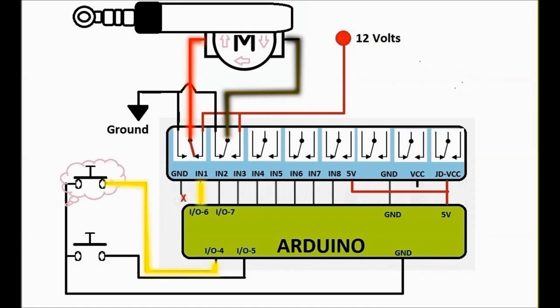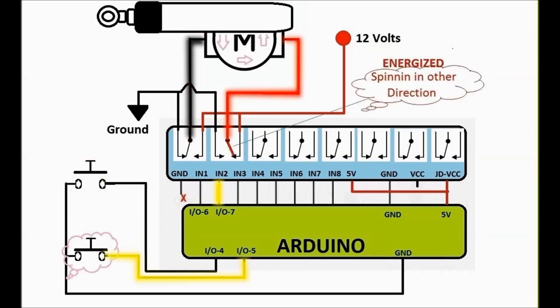In this project, though, on the sketch, on the software, we put a little delay in the critical part so that you don't burn the motor. Otherwise, the motor burns. So basically, you don't want to actuate that. The actuator for the door locks works the same way as the power window, but it only needs maybe a second or so, 2 seconds max, to actuate the door locks.